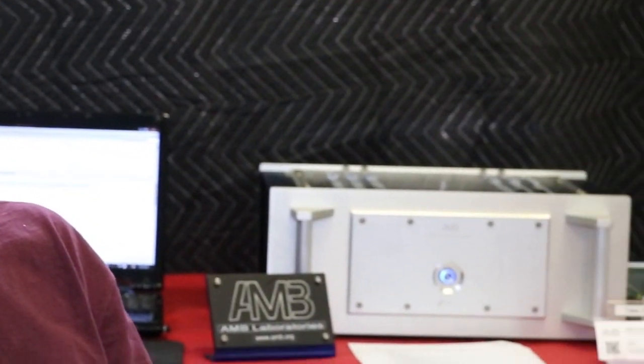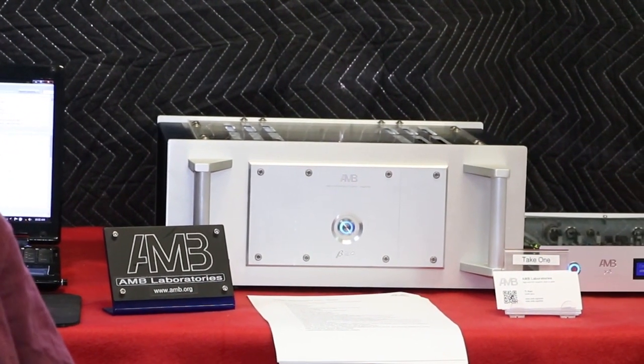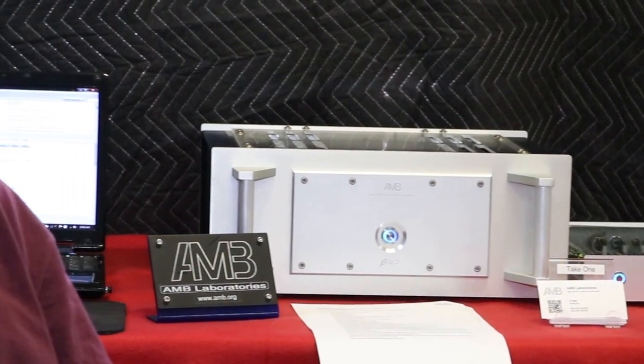This power amplifier is what I call the Beta 24. It's a fully differential, fully discrete design. Fully differential, so the speaker outputs, the plus and minus outputs, are both active, sort of like balanced or bridged. And the signals going in can be balanced or unbalanced, but the signal coming out is always balanced, even with unbalanced inputs. The topology is fully complementary in a four quadrant configuration.